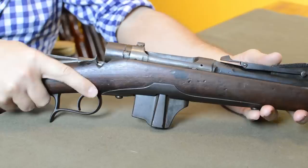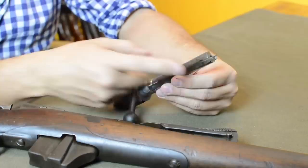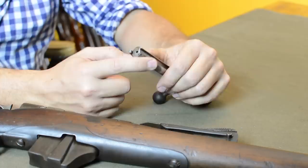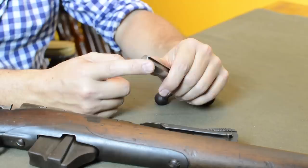The next bit we've got to talk about is just the bolt itself. We have an overhead extractor and then this protrusion — that was actually added; there's no feature like that on the original bolt because it was a single loader. You didn't really need to control the cartridge as you fed from the magazine. This is a rim support — it does a beautiful job of helping the gun pick up, move, and direct the cartridges into the chamber.